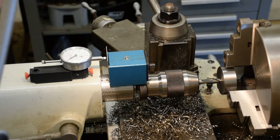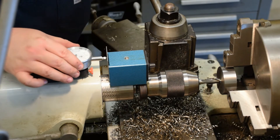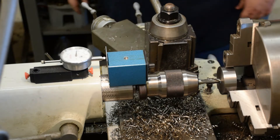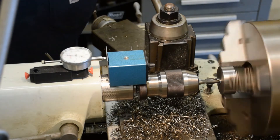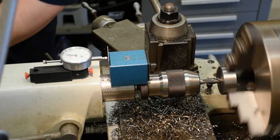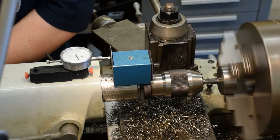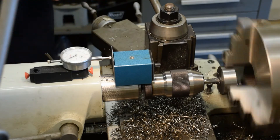I don't think it's necessary, but I'm going to go ahead and tighten down the pinch bolt too. Now we're touching and I zero my indicator. I'm going to back up off of there — don't want to blow something out — and I'm going to slow the speed down from 600 to 185 RPM. Okay, there's touchdown. There's a tenth... two tenths... three tenths... four tenths depth. We're done with the counterbore.